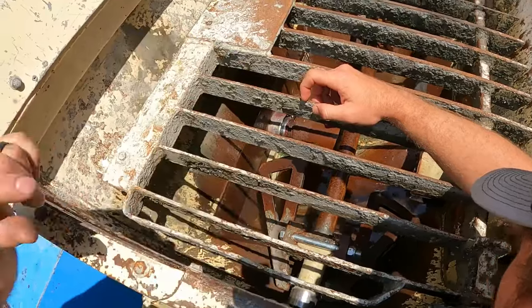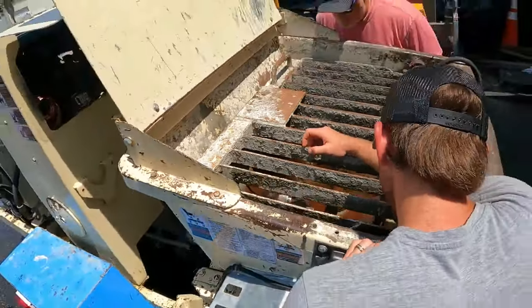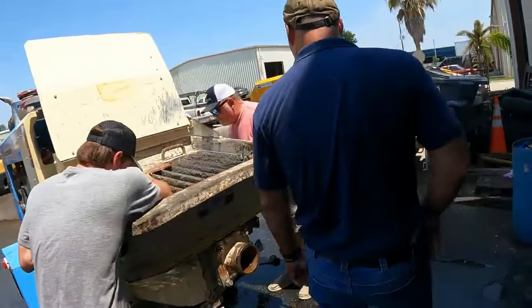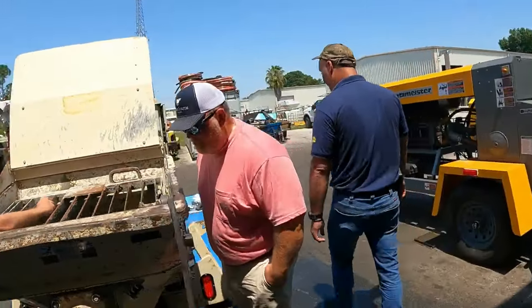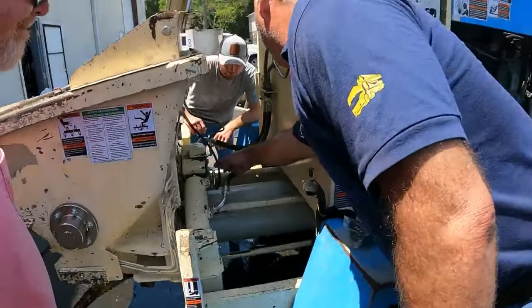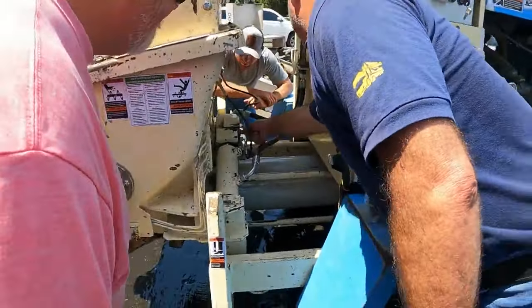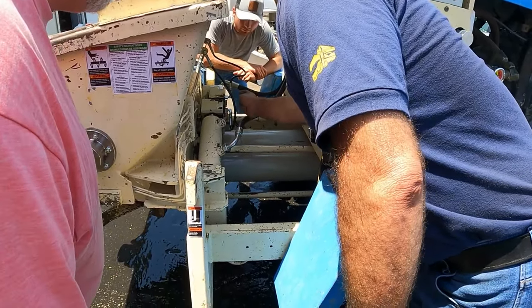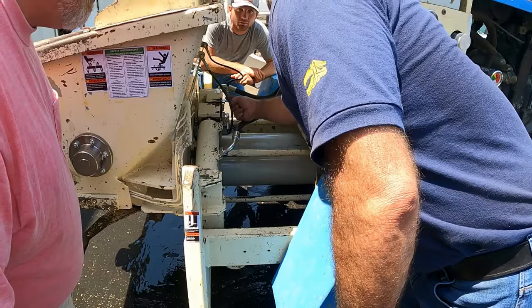Yes. You stick about 2/4 in there, and that's about where you want to stay. If you get about 3/4, then you're going to do a flat. This is a flat of a nut. So you're going to take these two lines off. They're 17s, 19 millimeters, and this plate's going to come off. You can't pump with it off, but for what we're doing, you take it off.